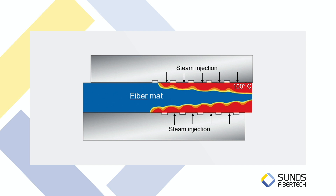By doing that, you will shorten the pressing time and gain a capacity increase of on average 20%. Secondly, after 70 degrees of temperature in the fiber mat, you start a softening effect of the fiber, and that will result in a reduction of specific pressure inside the press of about 30%.